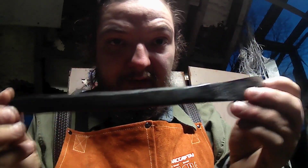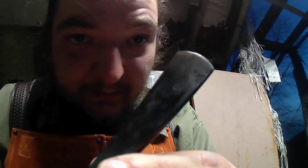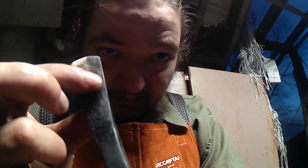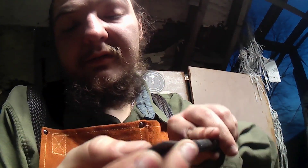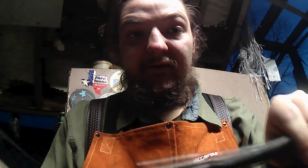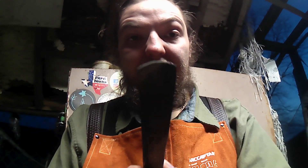She's all hardened up. We got purple back up into here, and then going further up we have gold and straw up towards the edge. So we kept our striking edge nice and hot, and once it was locked in we gave it a little time to cool off so we didn't over-harden everything. Next thing, we're just going to sharpen her a bit.